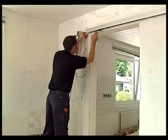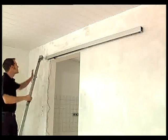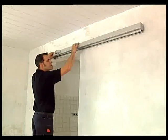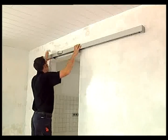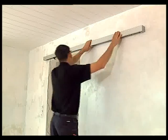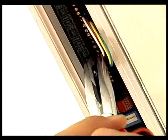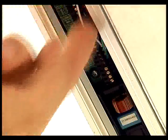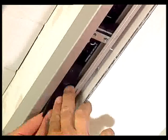After all activator cables have been laid through the hole in the control unit housing, you can fix the cover. You have to mount all further optional activators, also those on the opposite side, before you fix the cover. As soon as all activators have been connected to the connection terminals inside the control unit housing, you can close the lid of the control unit housing.